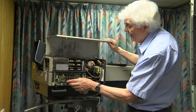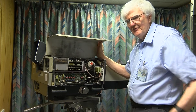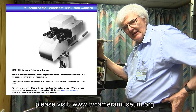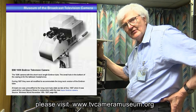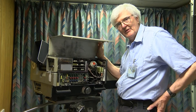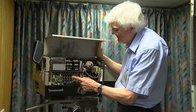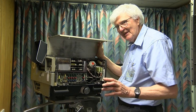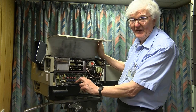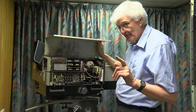This is an interesting little area of presets here — I found this fascinating. If you go back to before the war, to the EMI Emitron cameras with the iconoscope tube, there was a set of controls called tilt and bend, which we know these days as line parabola and line sawtooth, or field. Interestingly, those are these controls here, but EMI — perhaps some cunning engineer — has actually labelled them tilt and bend. Not a lot of people know that.